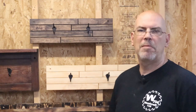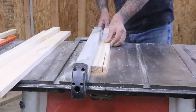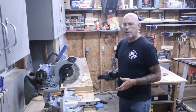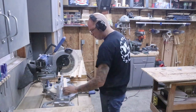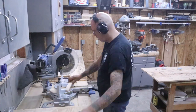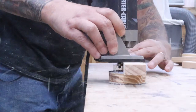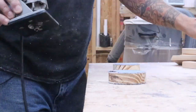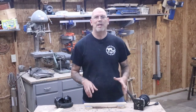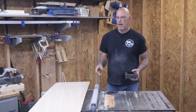We're going to start this one by taking a piece of one-by-ten and ripping it into one-and-a-half-inch strips. Then it's over to the miter saw where we'll take our sticks and cut them into random lengths, anywhere from four inches to eighteen inches — just chop them up and get them ready for routing. Now with the router set up with an eighth-inch round-over, we're going to hit all four edges on the face side and work through the whole pile. I set the fence to five and five-eighths and ripped a piece of three-sixteenths ply to use for backing.